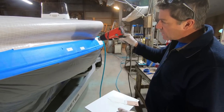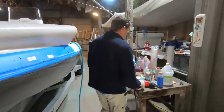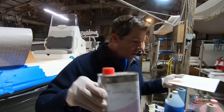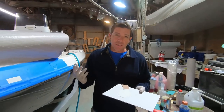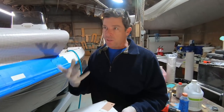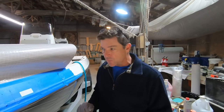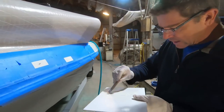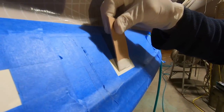We did not put any wax in this material. We have a product here called a sanding aid, sometimes called modifier C wax solution. On the last coat of gel coat you'll often put that in — it forms a barrier that allows the gel coat to cure. Unlike paints, gel coat is curing rather than drying, and it's got to have some kind of film — whether a wax barrier or another film — over the surface to help it cure properly. But on this first application we are not going to be applying any wax additive.